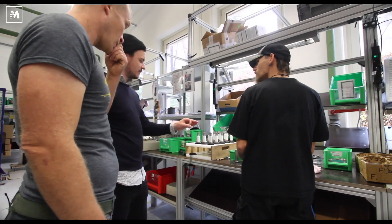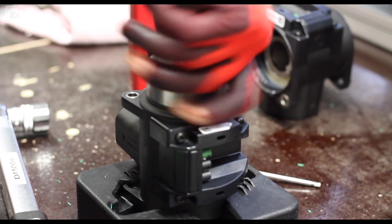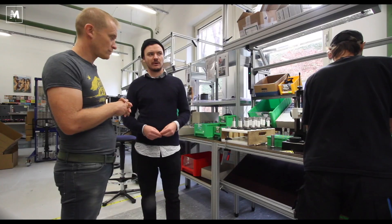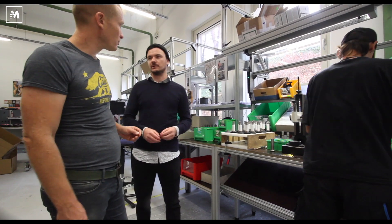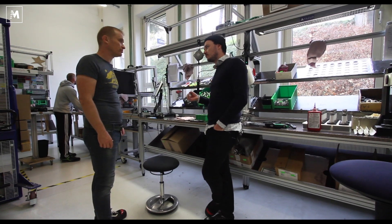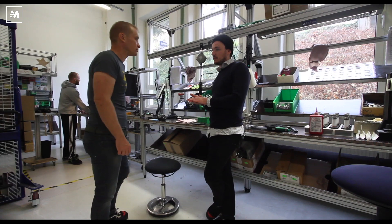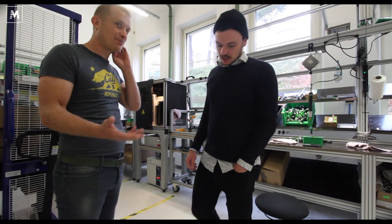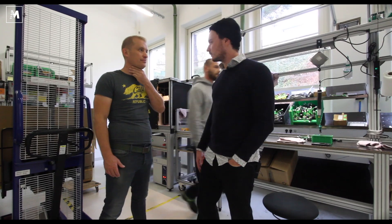This is where the crankshaft is pressed into the module that will be implemented in the rest of the bottom bracket. It's a hollow crankshaft with an ISIS standard. We are very proud to have the exact Q factor as you are used to with a road cycle. We also have the possibility of modularity, which is unique with Fazua — you can put out the motor and have a normal bike at the same time. We're not communicating production numbers, but quite a few.